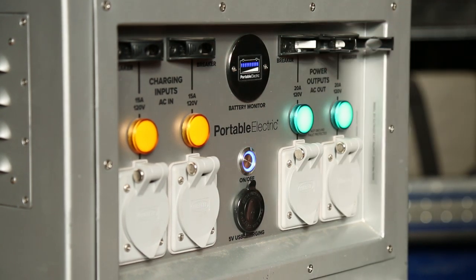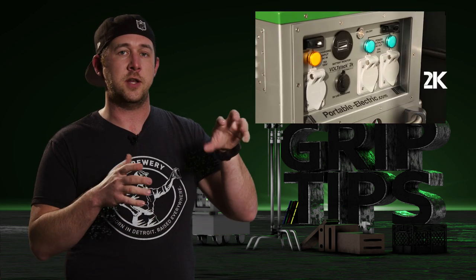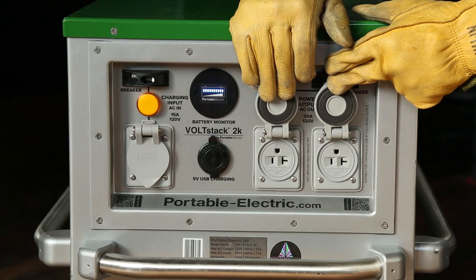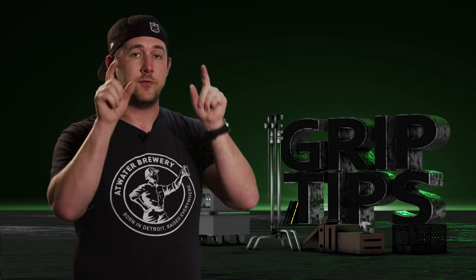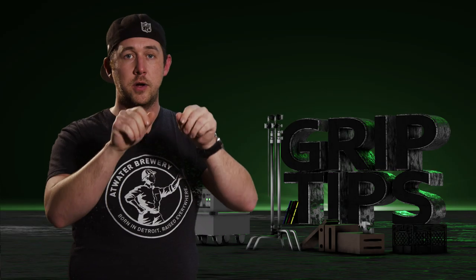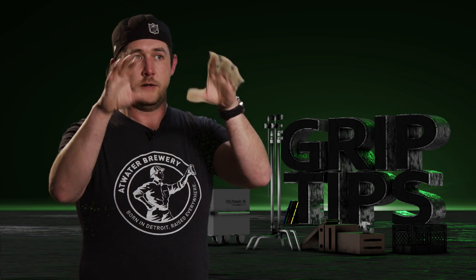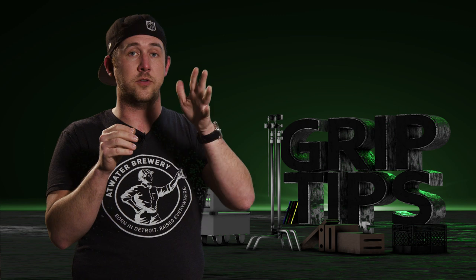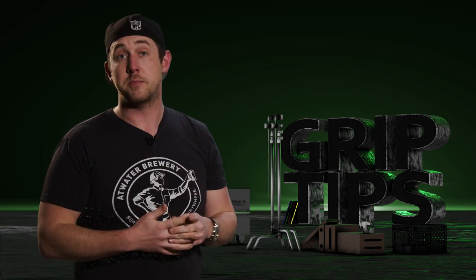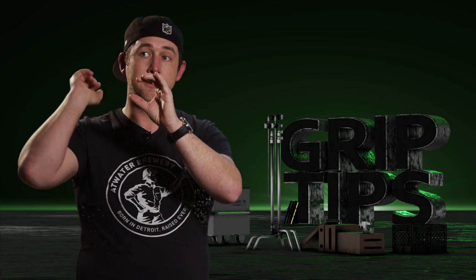Something to note if you're relatively new to power: on both the 2K and 5K units, they both have two plugs. The 2K unit is only 20 amps of power between those two plugs — so two 1Ks. However, on the 5K unit you have two plugs separating two 20-amp outlets, so basically you have 40 amps of power available. If you took a cube tap and plugged into both of those, you could run a few lights off each side — probably four 1Ks total — but no more in terms of paper amps or you're going to be tripping. The 2K: two receptacles, 20 amps out. The 5K: two receptacles, 40 amps out.